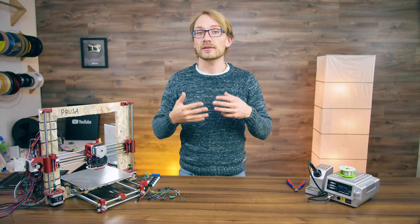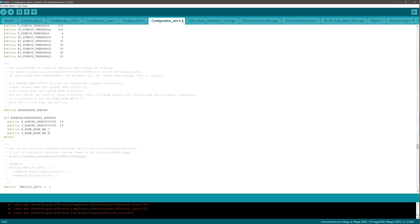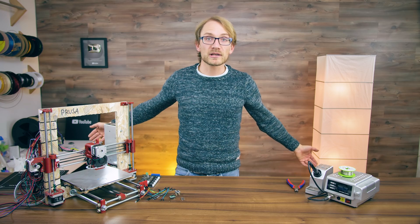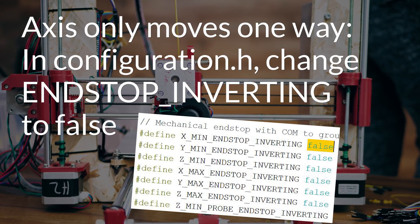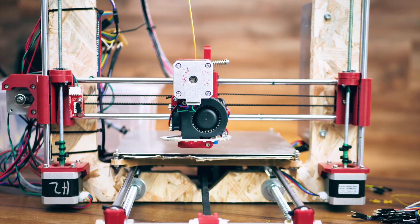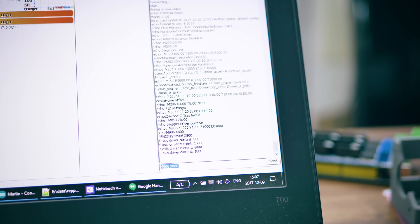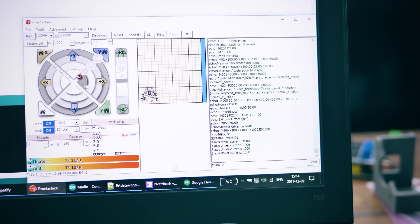Before we can upload the firmware, there are two more things we need to enable: automatic current tuning and sensorless homing. Again, these two are turned on by removing the double forward slash here and here. For sensorless homing, the default sensitivity setting should be okay for most printers, but you can play with it if it's too sensitive or not sensitive enough. It's also a good idea to add two lines right after the sensitivity setting to keep the printer from bumping into the axis ends too often. Now we can upload your freshly configured firmware to your 3D printer. Give it a quick test and check if the movement is working smoothly. You can adjust the motor current for each axis by sending, for example, M906 Y800, which sets the Y-axis to 800mA RMS, or have the firmware auto-tune the drivers by sending M906 S1. When you find your perfect current settings, don't forget to copy them into your firmware configuration and re-upload the entire thing to make it permanent.